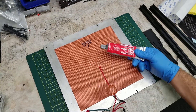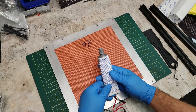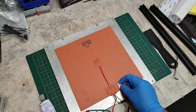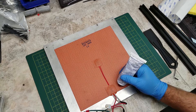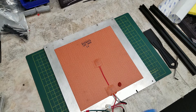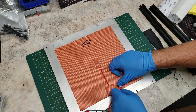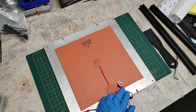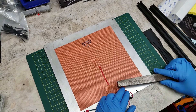Now for the temperature sensor, to prevent a runaway, we used to mount this to the bed itself. However, I've taken to using a new method where I use some high-temperature gasket sealant. This is the same stuff that I've used to make a sock for the Mosquito hotend, and I'm going to use this to attach the thermal cutoff directly to the heater mat itself. This way, if the heater mat does fall off due to the glue failing, the temperature cutoff switch will still be attached to it and should still do its job. Simply using a dollop of the high-temperature gasket sealant, I affix it to the back of the heater itself, and using a weight to hold it down, I let it cure for the recommended amount of time.